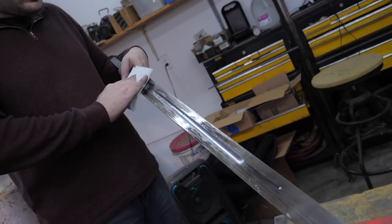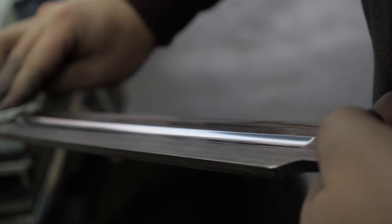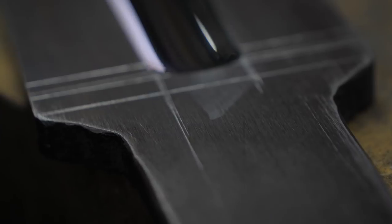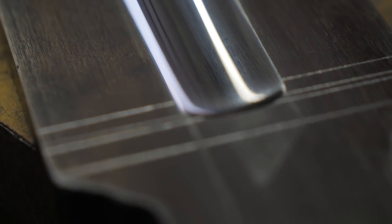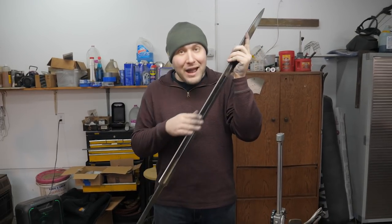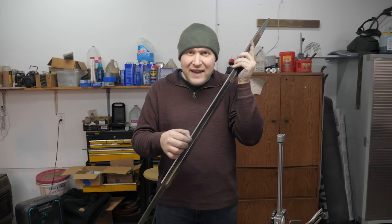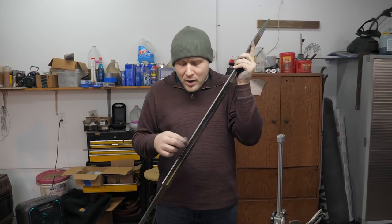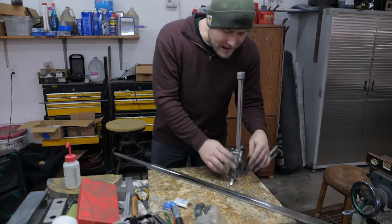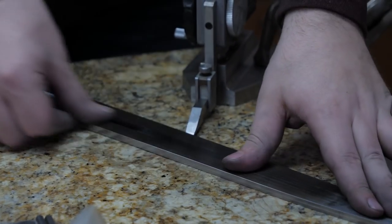The next day, the fuller is finally sanded. I spent the better part of a day sanding on this thing — my fingers are killing me from holding that little sanding wheel — but I got the job done. After the machine grind I sanded it with 600 grit by hand, then 1000 grit, and now it's at 1500 grit. It'll be pretty much untouched until the rest of the blade is done, and then when we go to finish I'll just lightly sand over it again. I've also marked out the edge of the blade — there's a mark right in the center of the blade I can use as a reference all the way through, and then about 25 thousandths of an inch on the outside of center, I have a mark on each side that I can rough grind to. I did that by setting my granite slab up and using my height gauge with a carbide tip, setting it to the right height and scribing a line all the way across the edge.